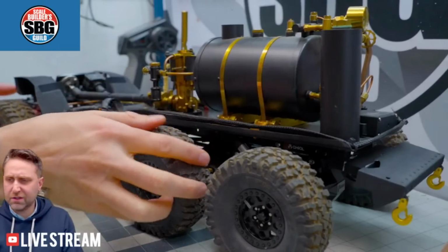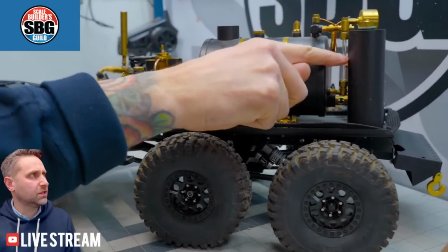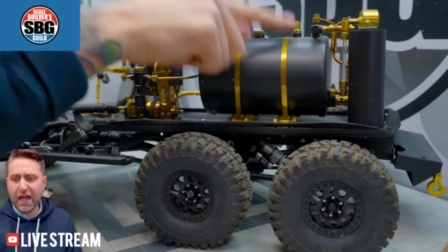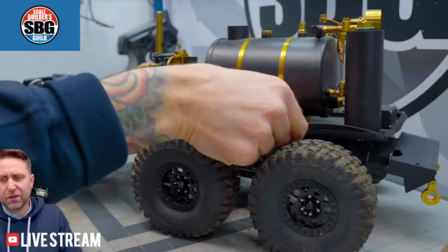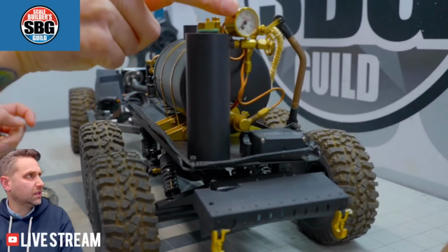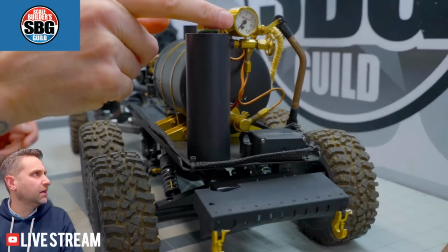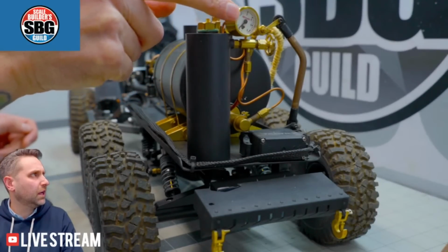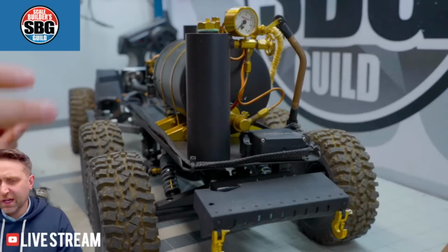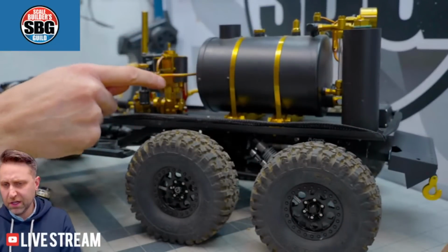There is also, it's sort of hiding behind the canister there, but this is your water level meter, and that should be sort of somewhere in the middle there. This is your blow-off valve. So if you get above, say, I think it's like 3 bar, 2.5 bar, and that's measured by this nice handy little gauge, let me turn the spot focus off there. This little guy here shows you your pressure output, and I've never seen it get above 3, but maybe it will tonight. Who knows?